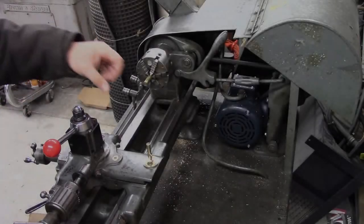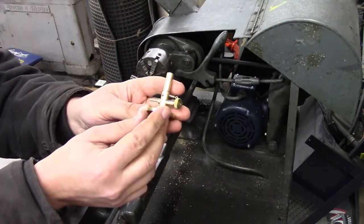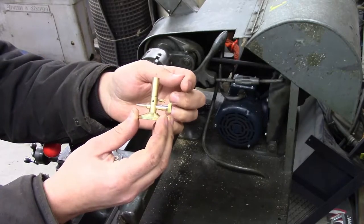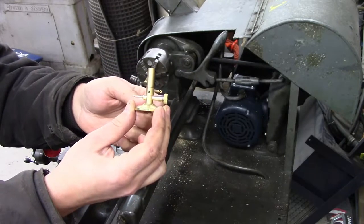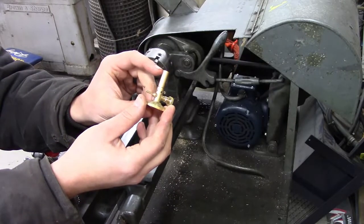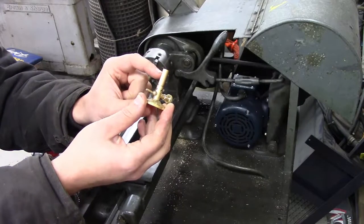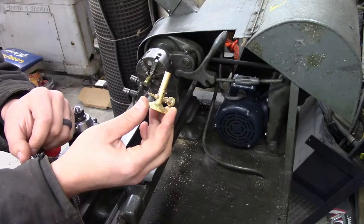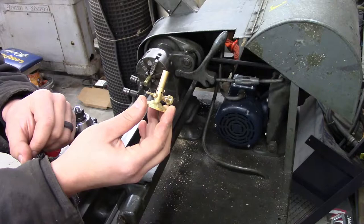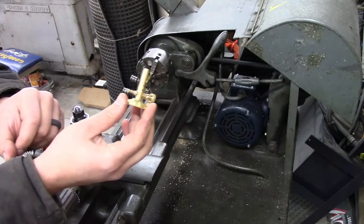So for this part, I'm gonna make an alteration from the original build. I'm gonna make a 90 degree head that'll stick off of the side here, about the same diameter as this base. Remember in the last of the last videos, we made this burner tip of the Venturi side. We made this slightly shorter to reduce the overall length, because there are some warnings in the original build instructions about getting this tube too long. So we'll get on with that.